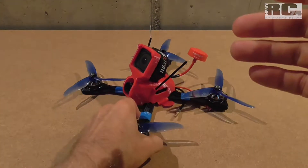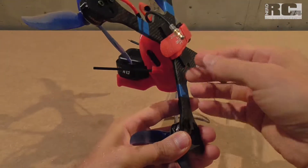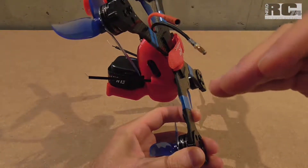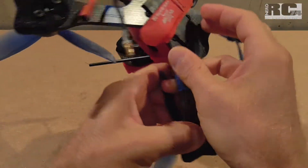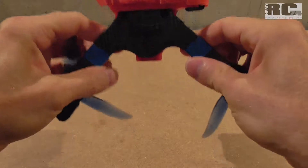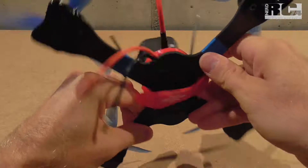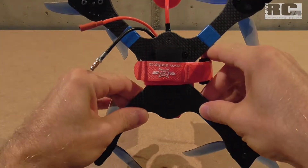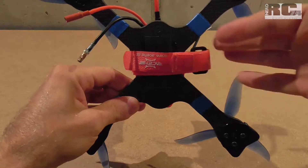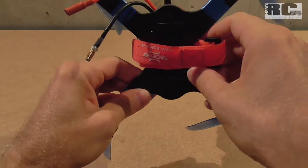The second issue was during dives. If you do a dive with your throttle at minimum, your motors just turn slowly, and normally your quad dives exactly straight down — no movement in roll or pitch axis. It just dives straight down, and as soon as you give some stick input it does the move you want.